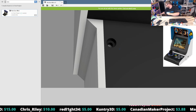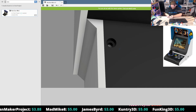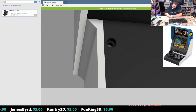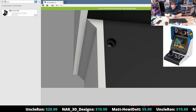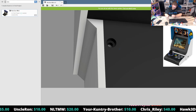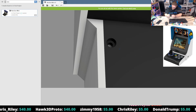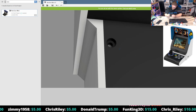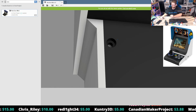Oh, here's some. I've got some M3 6mm. I think this will probably be both the M3 8mm to put together. 6mm will definitely go through both pieces of plastic, but I think you want to sink it a little bit more than that. The heads on these are 5.5, so 6 should do it. And how tall are they? They're about 3, so they should flush mount. Good, good, good.